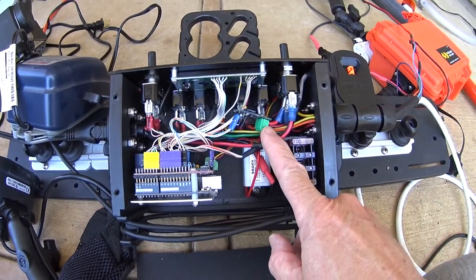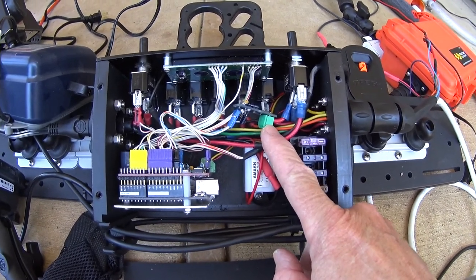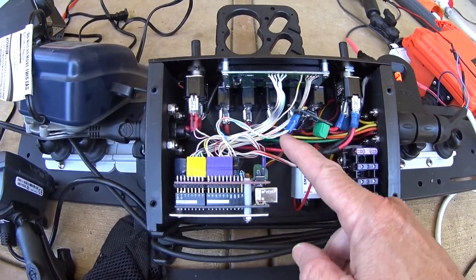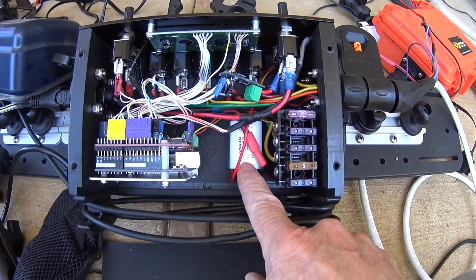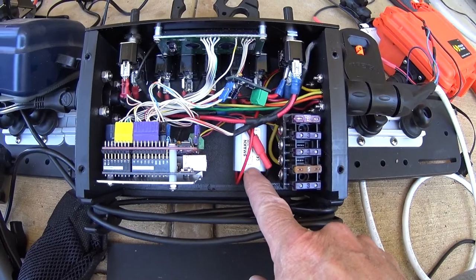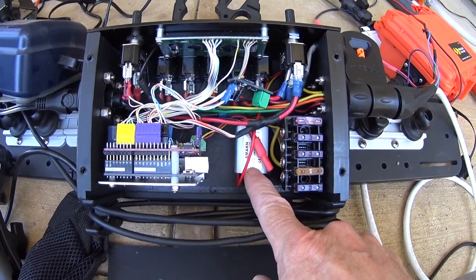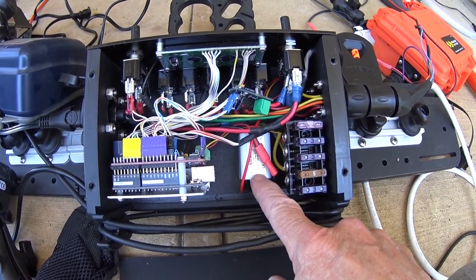There's a little circuit board with a Hall Effect current sensor that converts the current sense to a digital signal fed to the computer. Down here I've got a 12-volt to 5-volt DC-to-DC converter — the cameras use 5 volts through their USB plugs, so I needed to do that conversion. This is a high-efficiency device with a 90% efficiency rating.